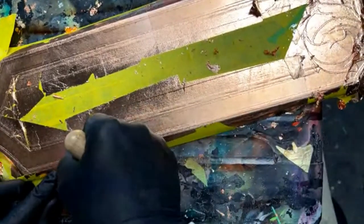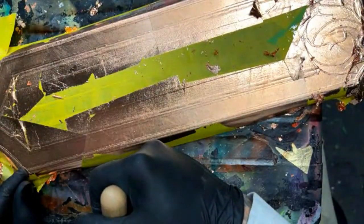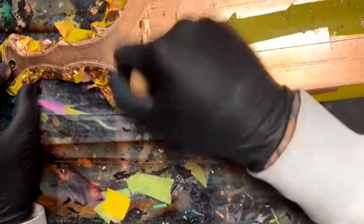Looks like there's a spot right there too. Let's see. And as you see, if you see spots where it's torn, fix it. Is that good there? I think that's torn a little bit right there. You can see right here, we've got a little bit of an edge. Gonna pound some leaf in that area, brush it out, boom, fixed it.